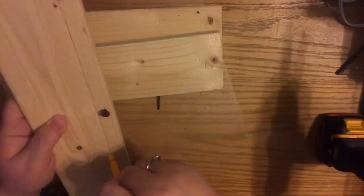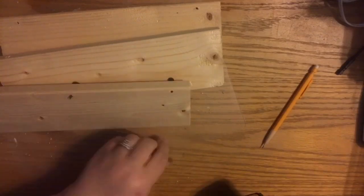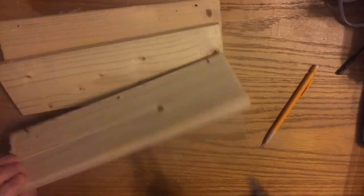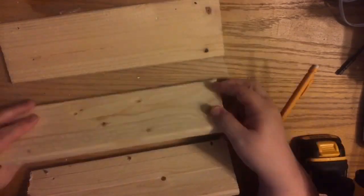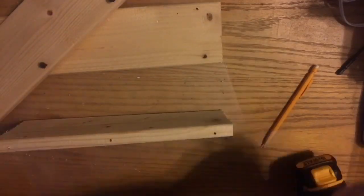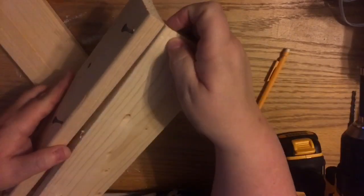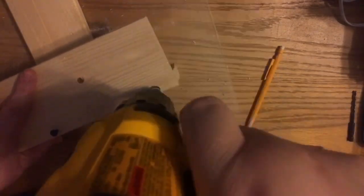I'm going to teach you how to use just nails and glue. This was just to show you guys some basic woodworking tools and they're not very expensive — you can get a drill gun or a screw gun for about $20 and the miter box was less than $10 with the saw. There are lots of tricks to using miter boxes, but I'm just going to show you a couple my pop taught me. The big one: let the saw do the work. Stop pushing, stop pulling — just let the saw do the work.